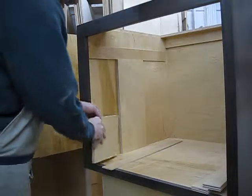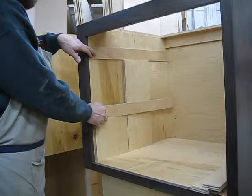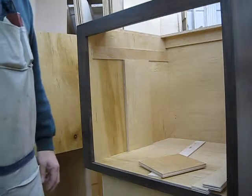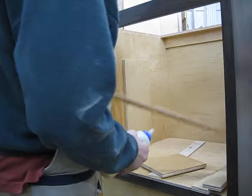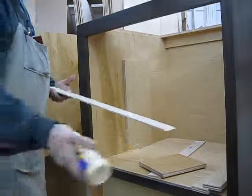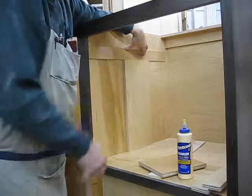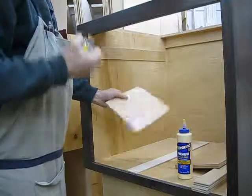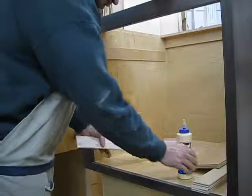The other spacer is at eight and a quarter, down here like this — that's where my two hardware pieces for the two file cabinets are going to go. I figured that out by measuring. I put some glue on this. This is inside a drawer box bank, so it doesn't have to look pretty — no one's ever really going to look in here. Whenever I've got something square I always check to make sure I'm putting things in the right spot.